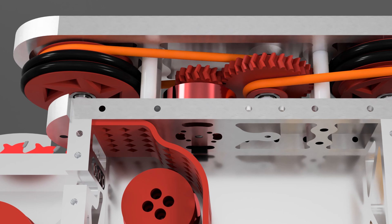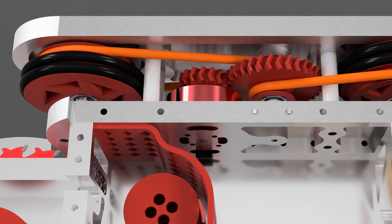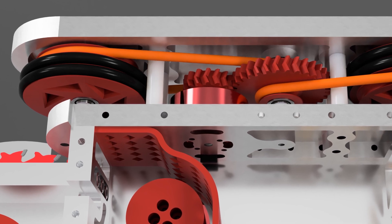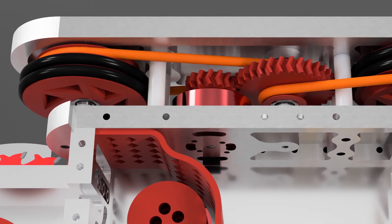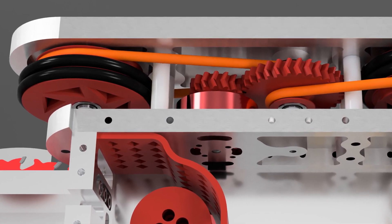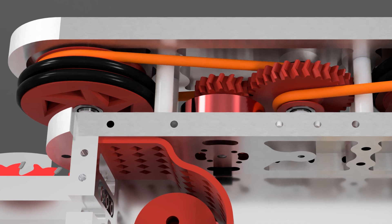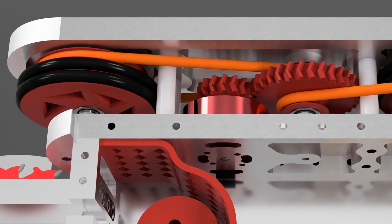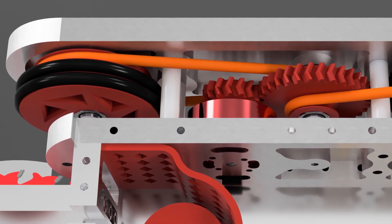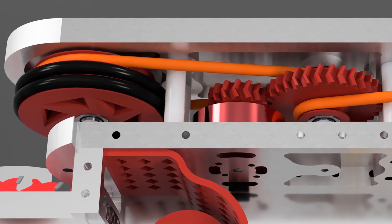Using O-rings in place of welding your own polyurethane belts works great, but you can also buy polyurethane belting from McMaster super cheap by the foot, and then weld belts of any length yourself using just a soldering iron — I'd recommend a very high-wattage one. I actually got a 100 or 120-watt soldering gun for this, where you pull a trigger and it heats up a big flat chisel tip so you can melt the two ends until they're smoking and then join them. Jonathan Schultz of Huge told me that using a lighter to literally light the ends on fire and shove them together until it re-solidifies also works very well.